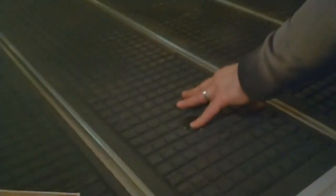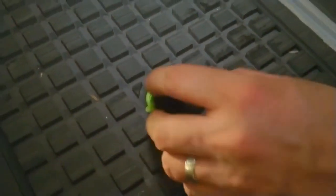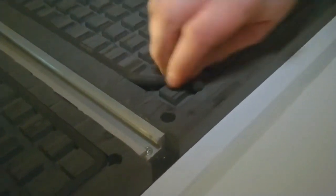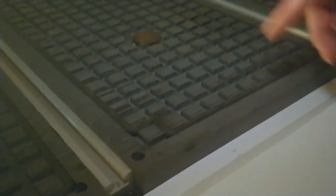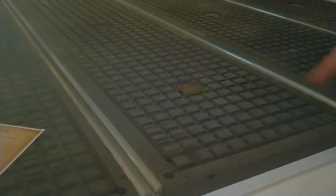This working surface is a vacuum table. Through these holes, air is sucked out of the system. And over here are these rubber bands — I can lift these out, like this, and form a different shape in the surface, like this. To make a zone where we suck the air out from between the part and the vacuum table, to just hold the sheet where it belongs, but only in those areas that won't be cut through. So I can limit the vacuum.